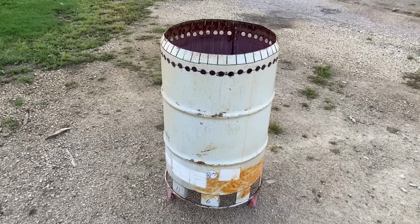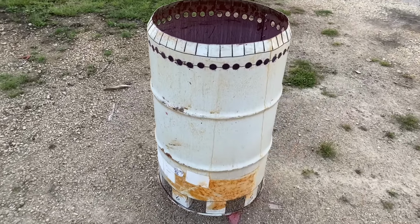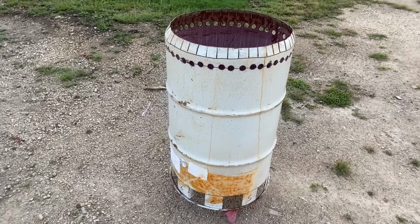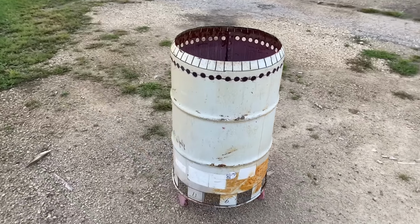Have a completed inner barrel. It has 3 formed legs, 6 holes with the tabs bent inward, the holes drilled around the top, formed upper edge, and of course it is a smaller diameter than when we started.